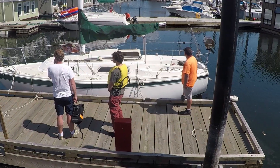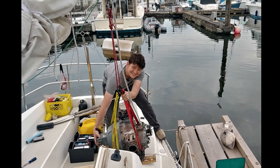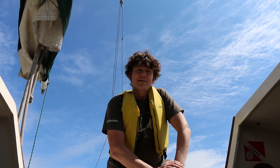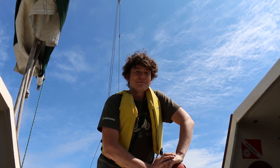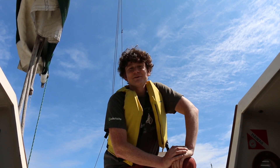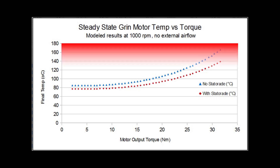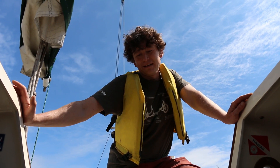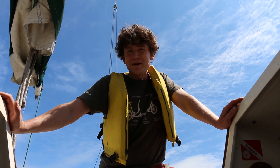This boat is a 25-foot sailboat that originally had a Yanmar 8 horsepower inboard diesel engine. 8 horsepower is a lot more power than e-bike motors run at, but it's also spinning at a much higher RPM. At full speed this propeller shaft typically does about 1200 RPM, and the torque required to do 8 horsepower at 1200 RPM ends up being around 30 newton meters — which is precisely the continuous torque capability of our direct drive Grin motor. So we had a little brainwave: if we just got one of these e-bike motors wound for a faster speed, it should have the capability of basically replacing a 160 kilogram inboard diesel engine setup with a motor that weighs all of 4 kilos.